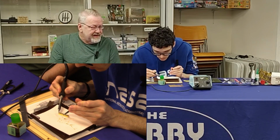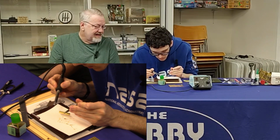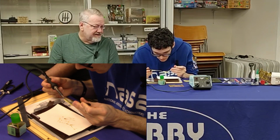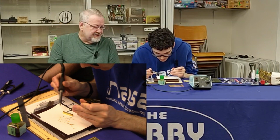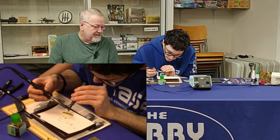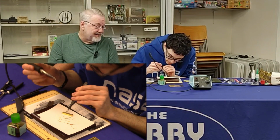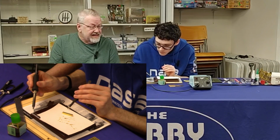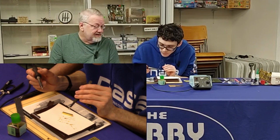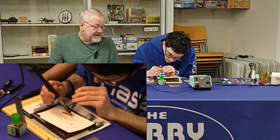Also, I didn't mention the iron that I'm using. It's a Weller iron, the most popular brand in the world. If you're going to look for an iron, make sure it's not a discontinued item that the solder tips will no longer be available for. That happened at the place I worked. We ordered a bunch of irons and found out we couldn't get tips half a year later. But it's a variable controlled, temperature controlled iron. That is essential for this.